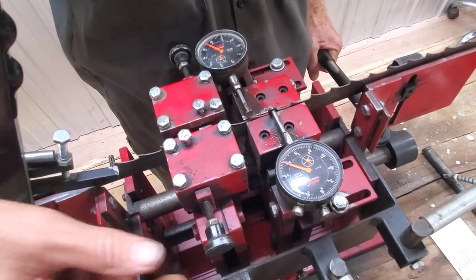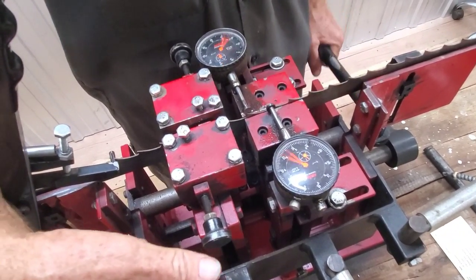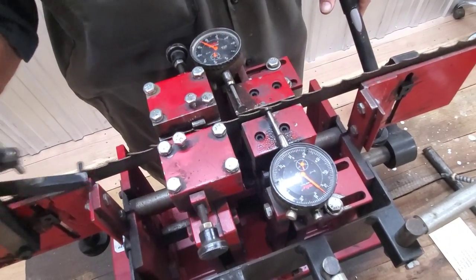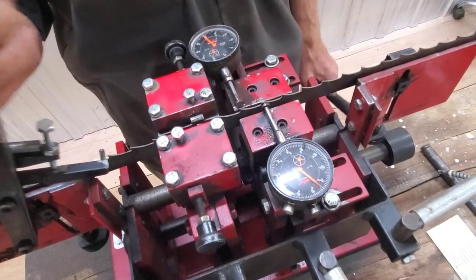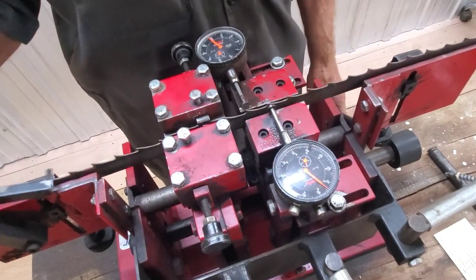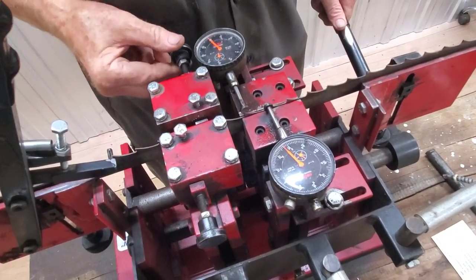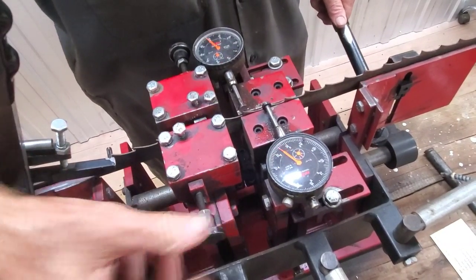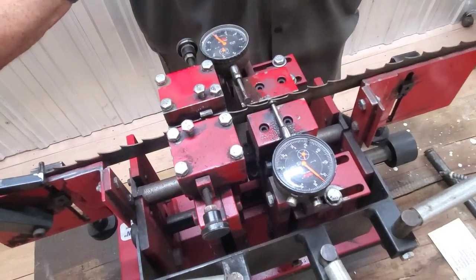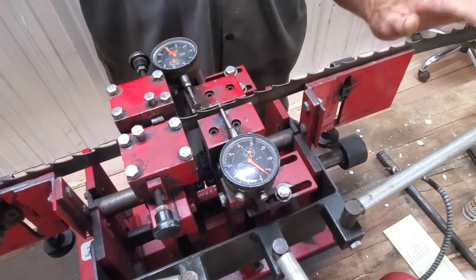We're right at 20 and 20, then 21 and 20 — that's a little off. He starts the count over. People will tell you that blade is the same thickness all the way around, but that blade is not the same thickness throughout — it will change. The thickness changes and then when you get to where the blade was welded together it changes again. He cut himself — that's an everyday thing. Everything on here is sharp, and the blade itself is actually decently sharp too.